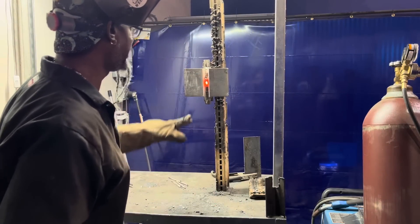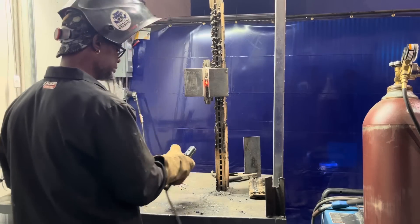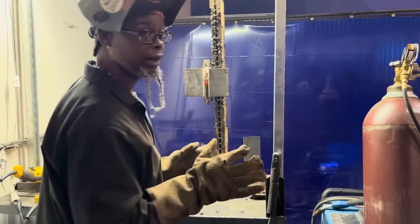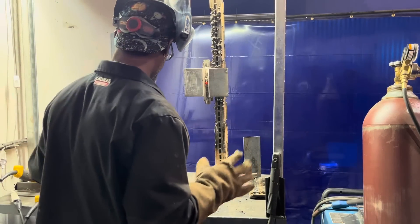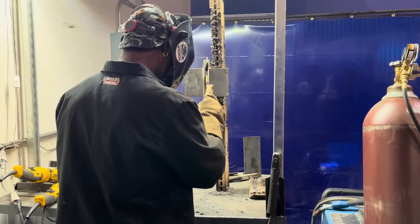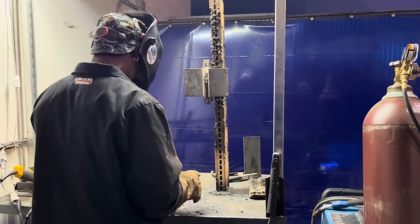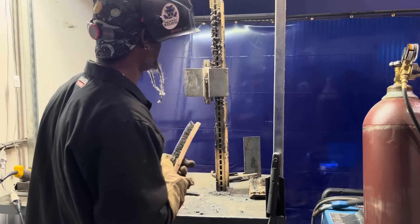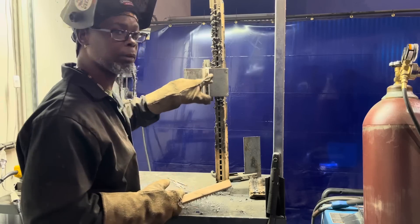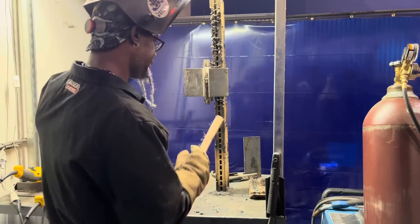I made it a little over the center of the plate — that's about normal, that's about good. I was hesitating on both sides. I'm not going to use any grinding wheels or anything — you want to act like this is a real test, so just use what you've got. When I start welding I don't take out all the slag at once — I take the slag off where I'm going to be welding, then remove everything before I place the next bead in.